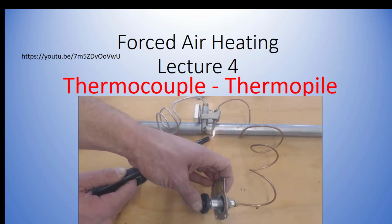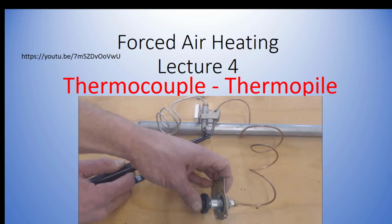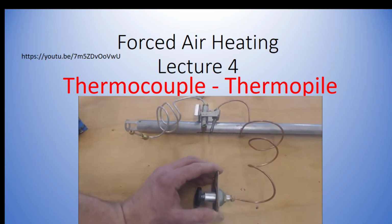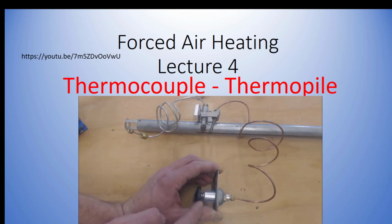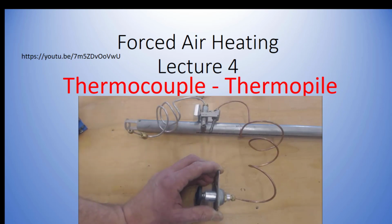So what we're going to do is hold this down, and this isn't much of a flame, but it should be enough. This is a 30 millivolt thermocouple. Okay, so you see that the solenoid is actually holding itself in. All right, we're going to see that this will pop back open again once that thermocouple rod cools down. All right, so now you see it popped open.